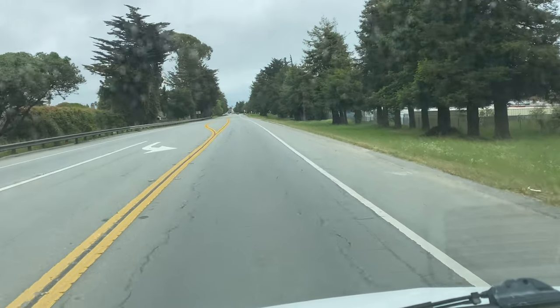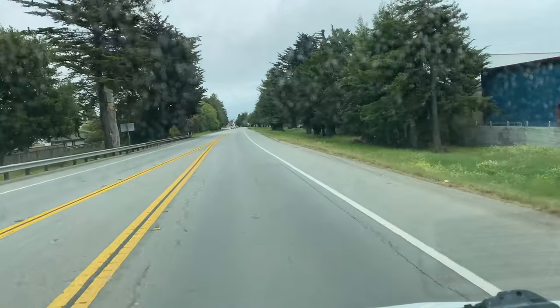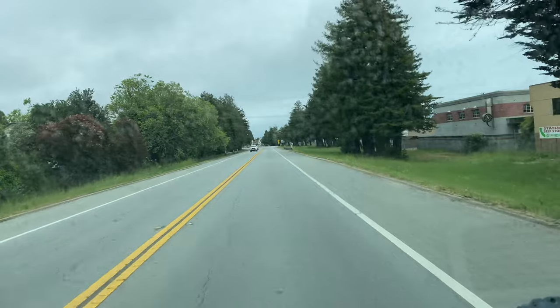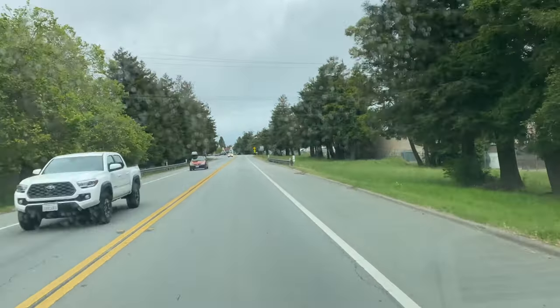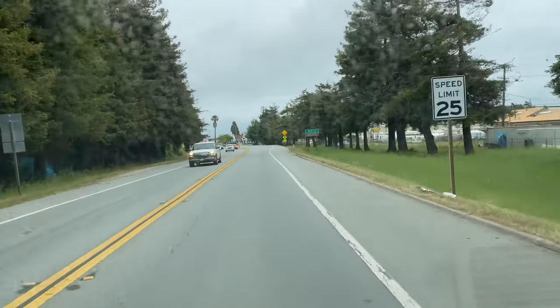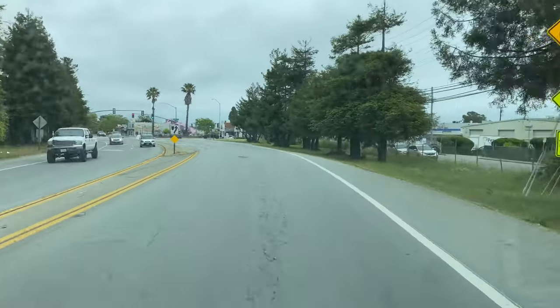Compressor video went to crap. I didn't get a ton, but I got more calls I gotta look at. I'll bring you guys along and we'll try and put together a video out of all the calls. Ooh, busy morning out here. I know I got a prep table to check at a sandwich shop, and then there's a liquor store that's got a solenoid coil that's buzzing he doesn't like inside the wine cooler. We'll check incoming voltage and see if maybe the coil's just weak. We need to replace the coil on the solenoid valve. He had sent me a video where you get a solenoid that's buzzing a bunch, and we'll try and get a look at that also.